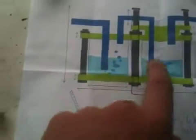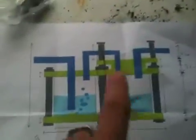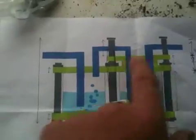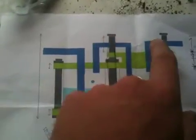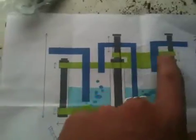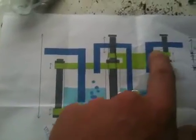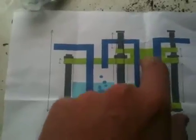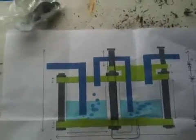I'm going to put a series of valves in here as well. What I'm building is — this is the interesting bit — a pop-off valve, spring-loaded. Four corners with springs, so if there's an ignition inside the first chamber the top will just pop open, release the energy, and then spring back down again and reset itself. That's the idea at the moment.